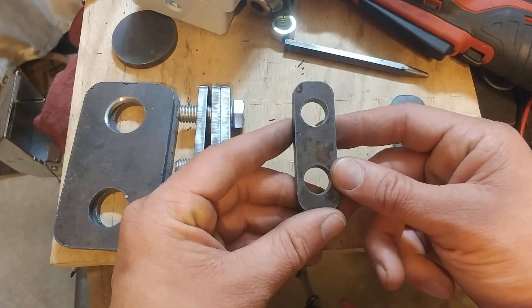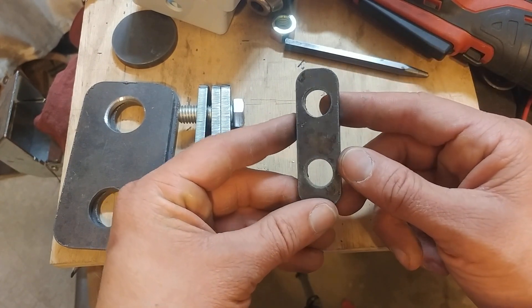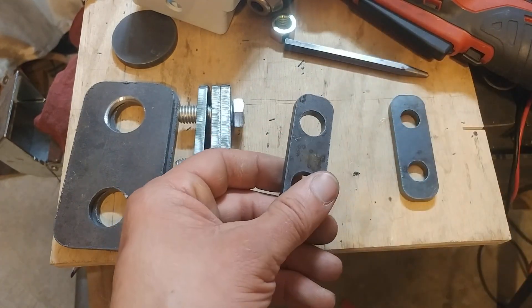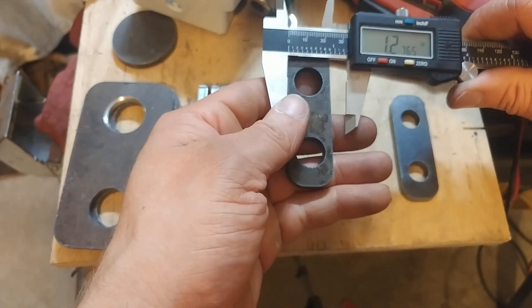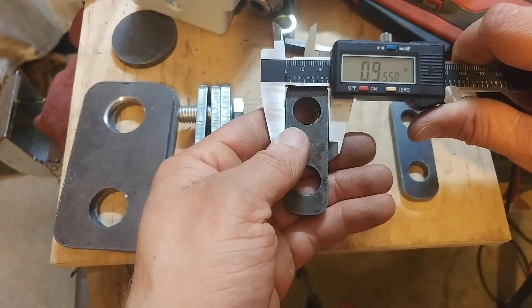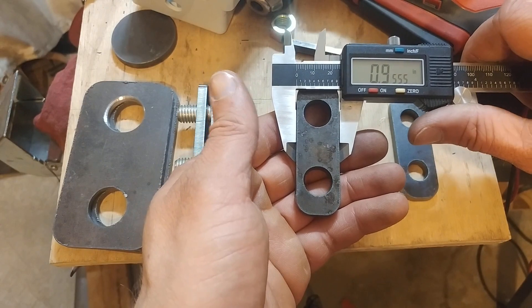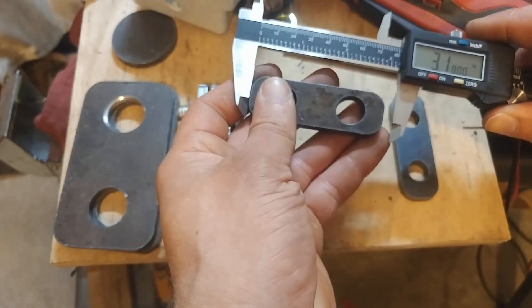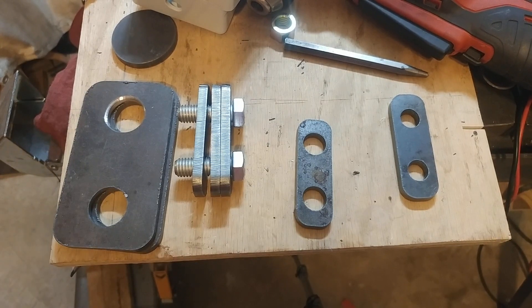That's where we have all these here, and then also this whole plate of botched-up cuts. The first one was the right shape, and you can see the arc lead-in and lead-out gave you a very nice circle, but it's also way oversized in the holes and way undersized in the outer dimension — coming in at about 0.95 inches, about one kerf width off. I realized Inkscape wasn't accommodating the kerf width, even though one of the parameters you enter is the diameter of your kerf — the diameter of the torch tip, the cut width — it doesn't account for that when doing the G-code.